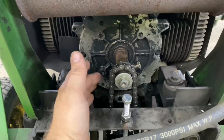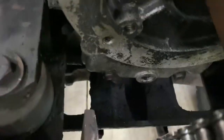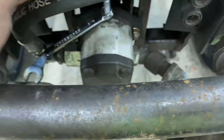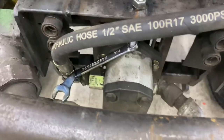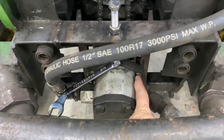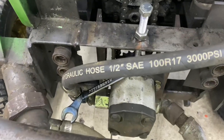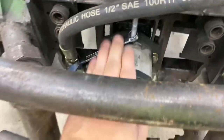I was running a belt, but now I switched it over to a chain drive down to the pump. I kind of just zip-tied this wrench to the pump because these bolts — you gotta have a bent wrench, which I didn't have one. So I had to heat it when bending it, so I'm just gonna keep it with the unit.